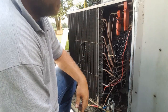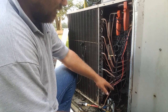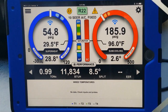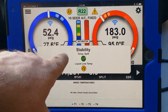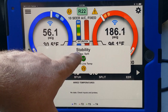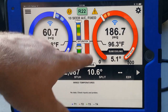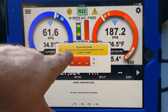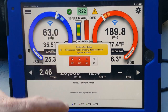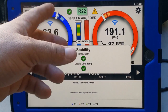This goes on to the line returning from the evaporator. Everything is set up — I'll tuck the wires and start the system. Our system has just started up and we have two insignias on screen. Temp split is stable but will become unstable before it's completely stable, and liquid line temperature is still increasing. We have the warning: 'system cannot be properly diagnosed until the system is stable.'